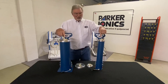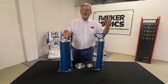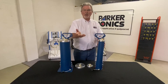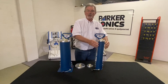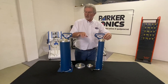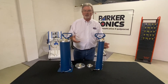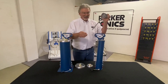What we have here are the hopper lids. We have our injector connection points, and this is your hopper vent. If you don't vent your hopper, it pressurizes and becomes just like a pressurized paint pot — it pushes powder out rather than the gun and controller doing so. We always want to have the vent open and clear. If it becomes a problem, you can put a small piece of 10 millimeter tubing into your booth or exhaust system.